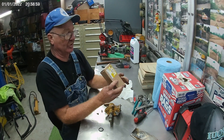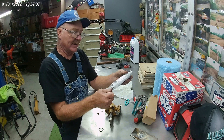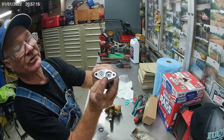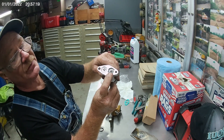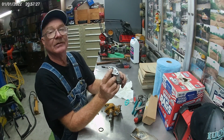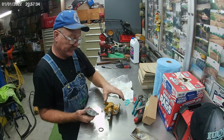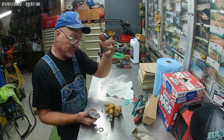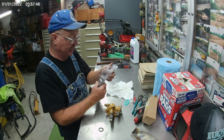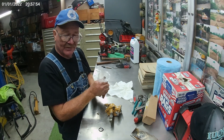The other check valves I was going to show you are in the hand primer pump. If you take a hand primer pump and it won't pump or it's just going back and forth, look inside — there's another in and out valve. So if your hand primer pump ever gives you trouble, you know what to look for: two valves in the primer, three valves in the transfer pump. This is off a 3304 — the 3306, all of them, they're all about the same. The housings change just a little bit, but they still have those one-way check valves and still run about 40 pounds of pressure.